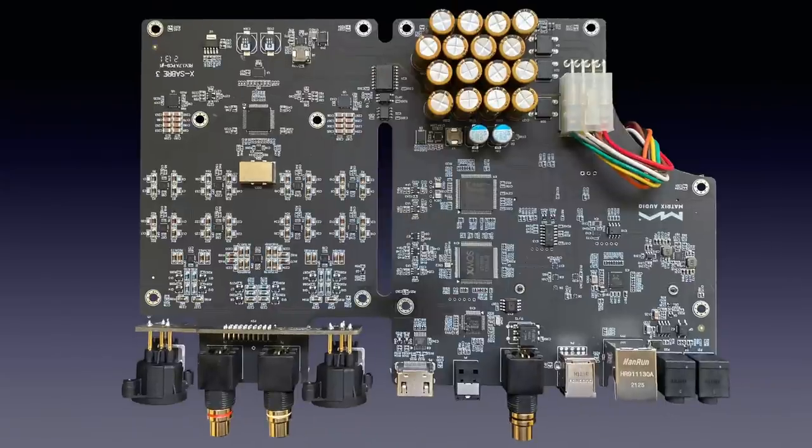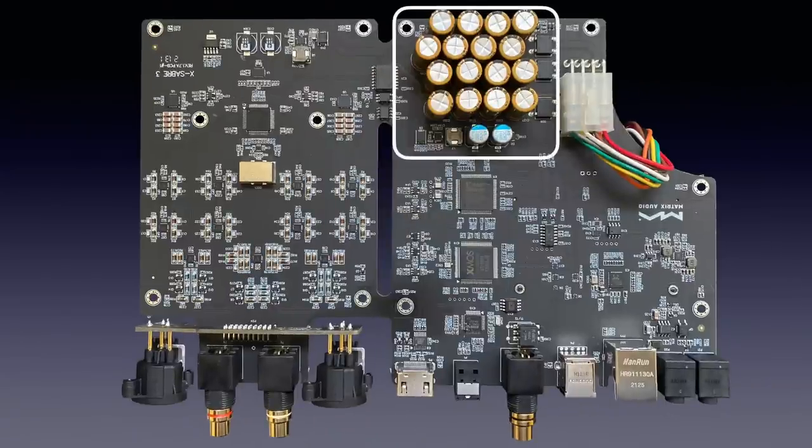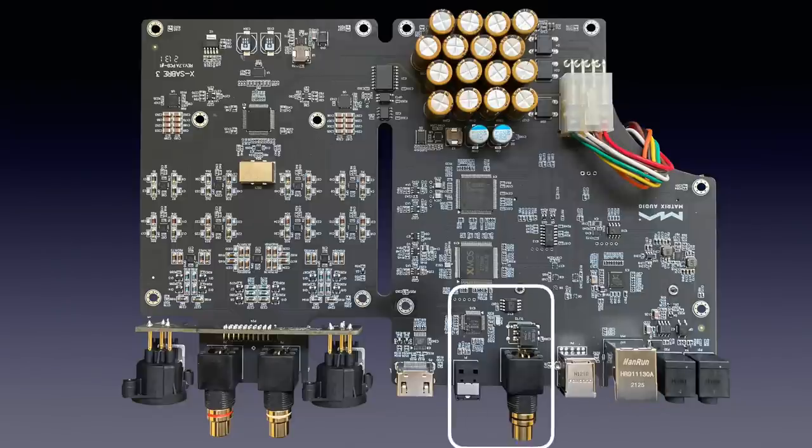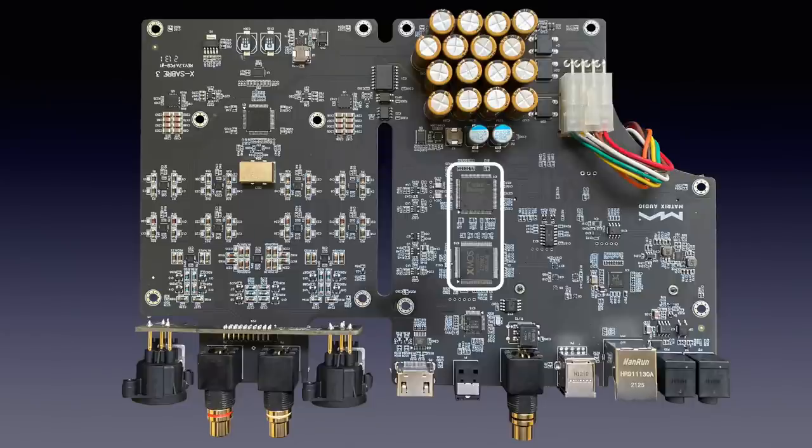When we look at the flip side of the board, we see the rectifiers and 16 Nichicon 1000 microfarad capacitors for buffering. On the input side, the Ethernet connector with the Realtek interface chip. The SPDIF input is transformer-decoupled and has a TOSlink input next to it. The I2S input is directly to the left of it. The number crunching is done by an XMOS microprocessor that handles the interfacing, and a Xilinx Spartan that does the filtering and MQA processing. Like on the other side of the board, there are galvanic separators to avoid a dirty ground plane on the audio side.